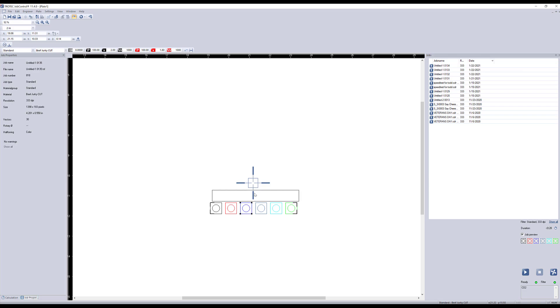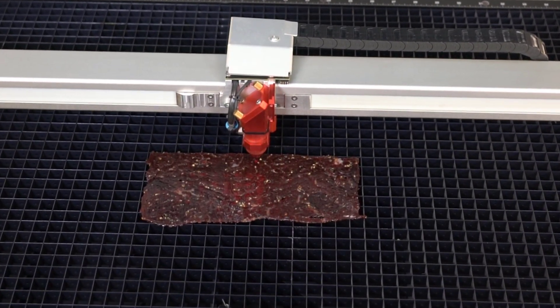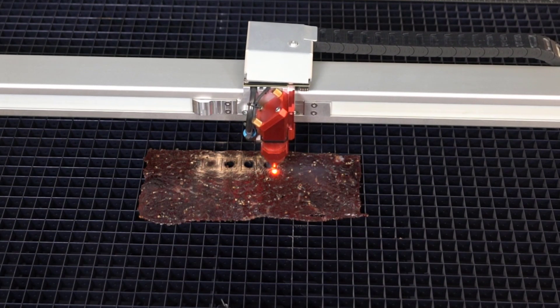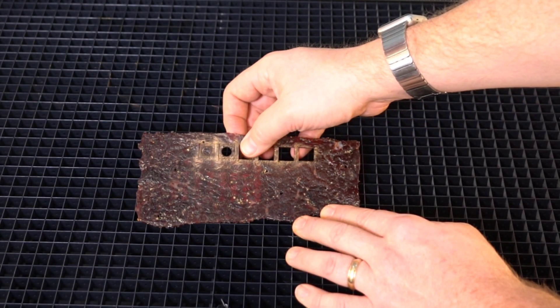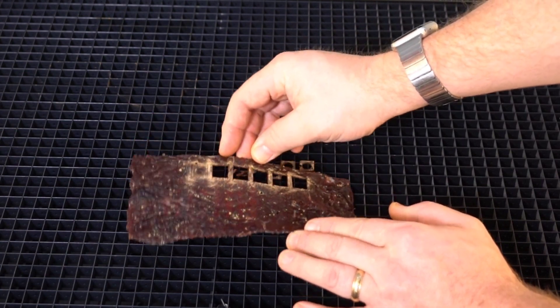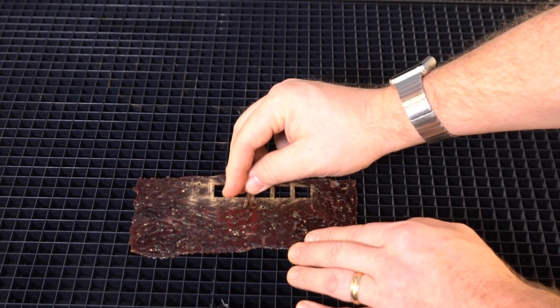Let's bring this file out in Job Control, snap it to the cursor, and go over to the laser. We're still focused onto the surface of the material from the engraving process, so let's push the start button and see which setting cuts it. Here is the fastest one — the second one looks like the circle is cutting out. Looking at the results, it definitely looks like 1.4 speed is giving me my best-looking cut for this material.